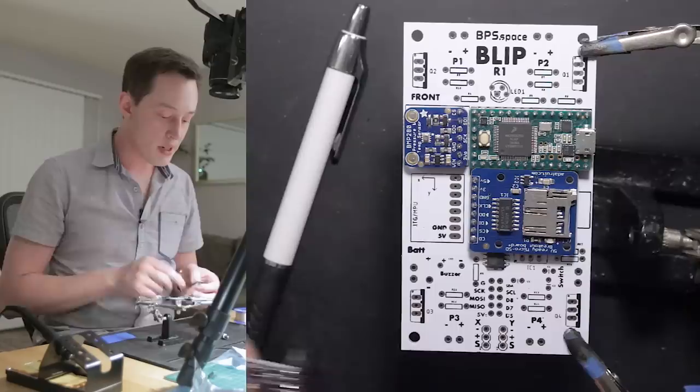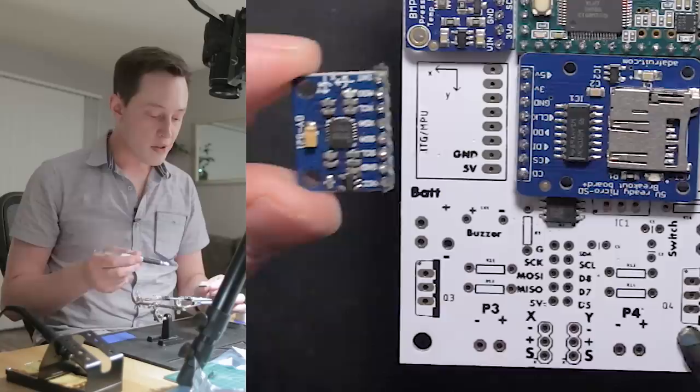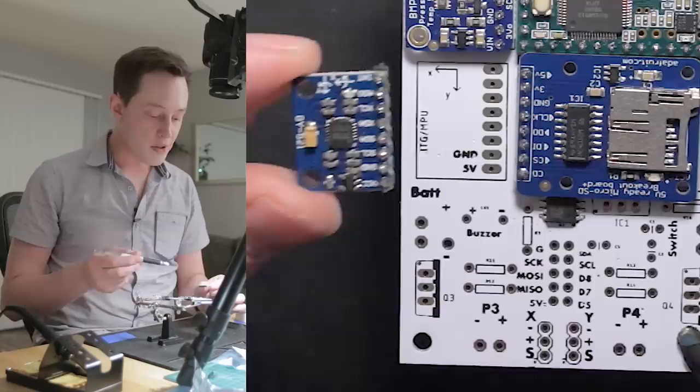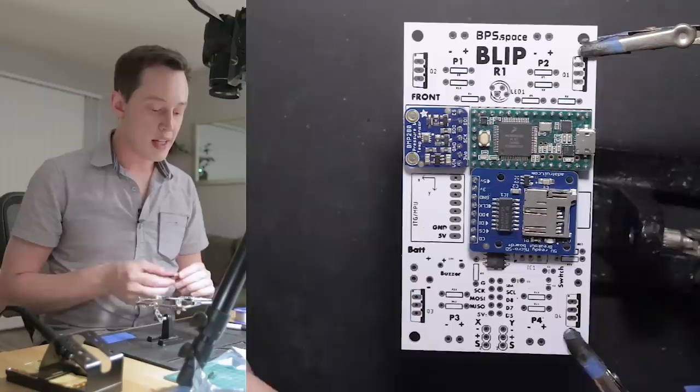These are model rockets, so it's okay if there's a little bit of imprecision here — however, you should try your best to get these pins super perpendicular. These are things we can correct for in software, but every amount of precision that you can get with your soldering and your joints on this PCB is going to help your rocket fly a little bit better. Now this is our last breakout board piece. The MPU6050 fits in this direction — there's a little X arrow and a Y arrow on this board, and the X and Y face in the correct directions that correspond to the Blip board. Ground and VCC pins also correspond on the Blip board, so that's how you know the orientation.